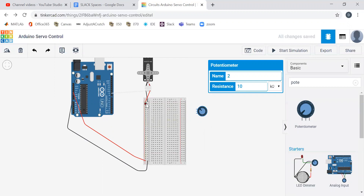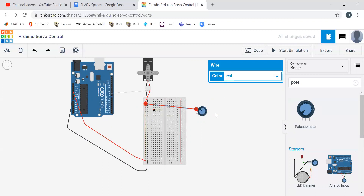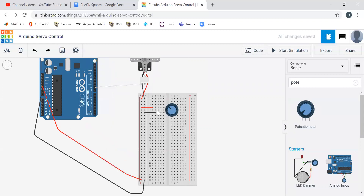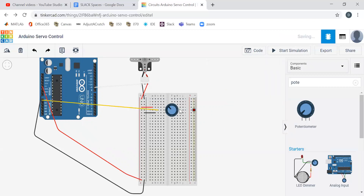Let's give it a try. We're going to put terminal one up — let's go to red there. Let's plug it into our breadboard. So plug into our breadboard, right here. We'll go to terminal one directly over, and we have plenty of red wires. Terminal two we'll go black. We want to take readings from that middle one. When we're taking readings and taking ranges — when we say range we want to have analog, and when we say readings we want to analog read. Let's change that to yellow.